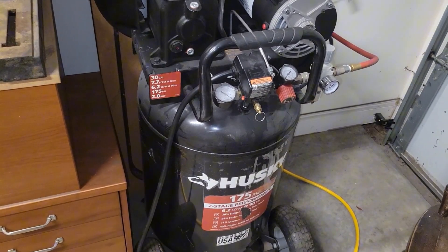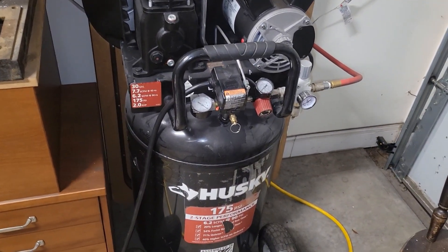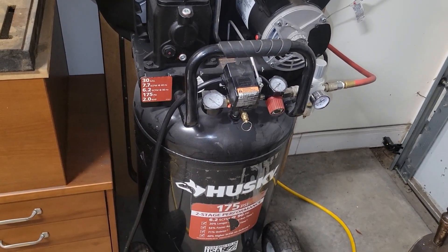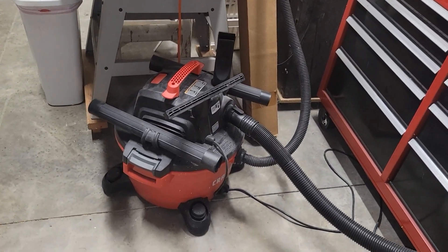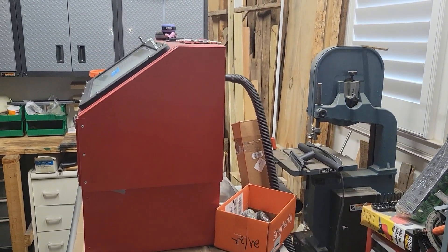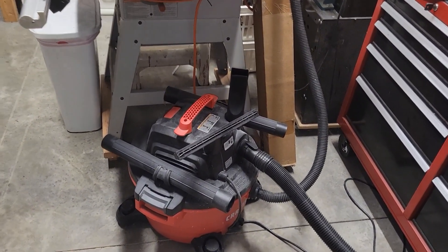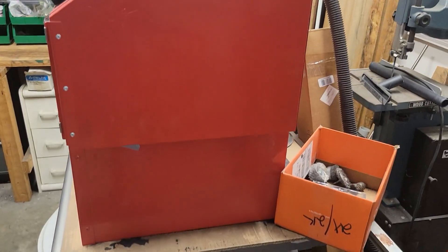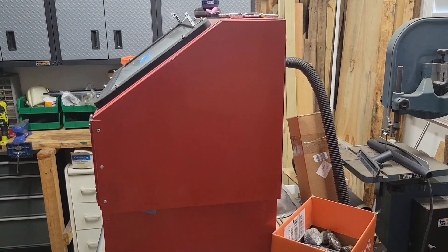This thing has a duty cycle — I think it's like 50 percent — meaning it's not supposed to run continuously or it'll overheat. I think it has an automatic shutoff for overheating. Also, just a quick reference: I have a shop vac, and if you're going to have a powder coating booth you need some kind of vacuum pulling the extra air out. Otherwise all your media or material is going to pool up everywhere and shoot through all the cracks — you have a ton of air going into the sandblasting cabinet and you need some way for it to come out.